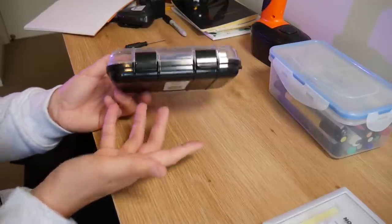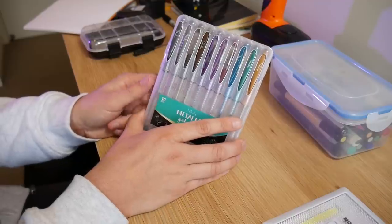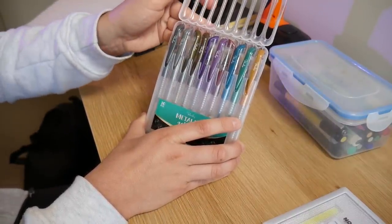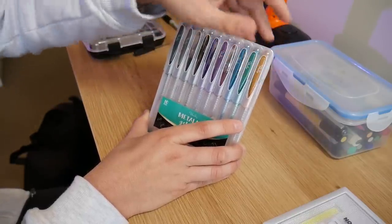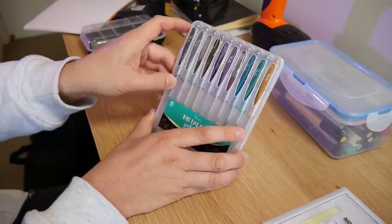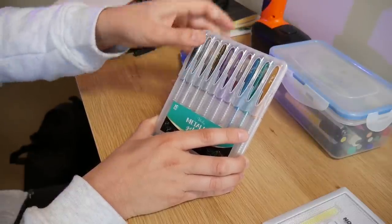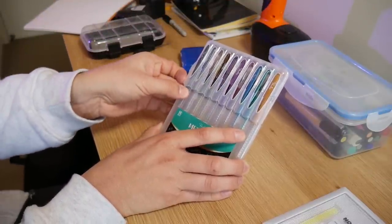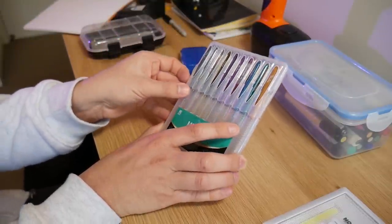Let's look at something a fair bit cheaper — this pen box. It has two snaps and is designed to snap a plastic cover in place. This is just packaging and it's quite clever how they've done it as cheaply as possible. This design is a semi-permanent snap: you don't need much force to open it. It's not really designed to be all that strong — it just holds the cover in place and isn't holding any load.